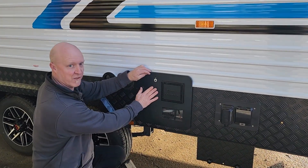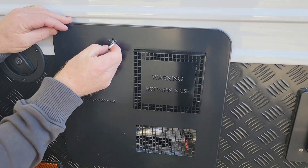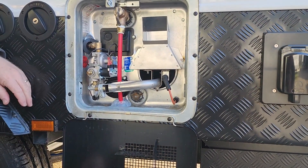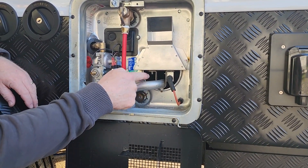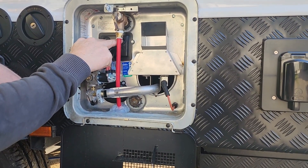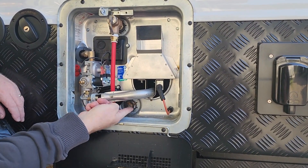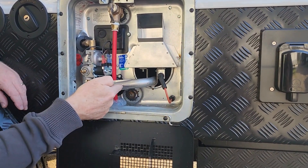The anode is in behind the main cover. We've got a little clip here that allows us to just flip up, rotate around, and then we can open the service access door. That just folds down on this hinge and as you can see in the back here we've got all the workings of the hot water service: gas control valve, the gas flows through here to the burner and the flue. You've got a pressure relief valve, a reset in here for the thermocouples, and your igniter. Underneath here there's a black cover which is where your 240-volt element goes, and this big nut in the bottom here is where the anode goes inside the hot water service.